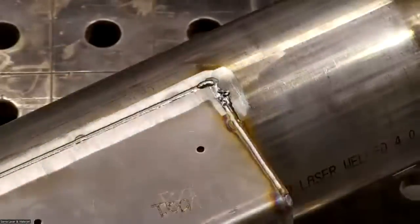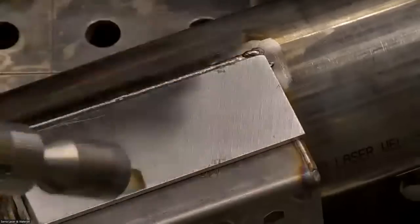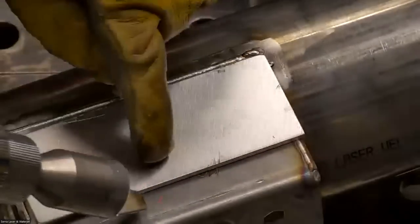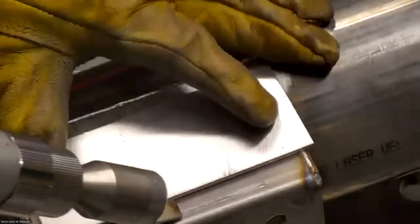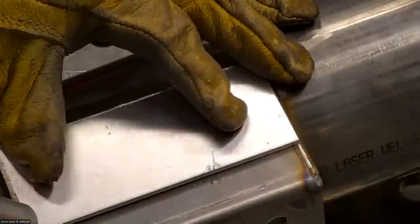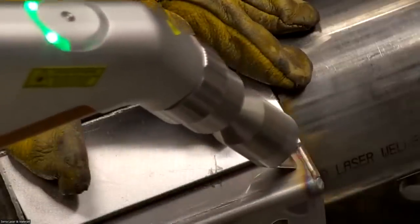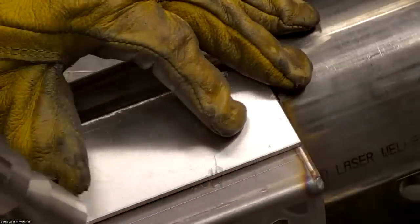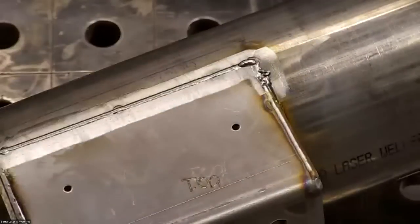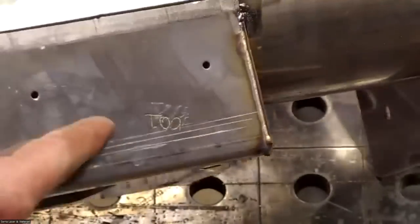And you could also scribe a line. This is kind of a cool use. A customer actually showed me this, and I said, you know what, that's a great idea. So let's say you wanted to scribe a line. You have the laser to guide you right on where you need to be. So you can put the laser there at the front, put the laser at the end, and use this as your guide however you need. And then that's a precise line that's in the material pretty good.